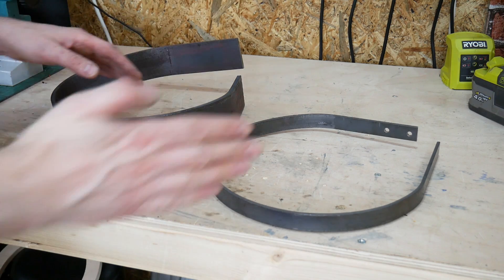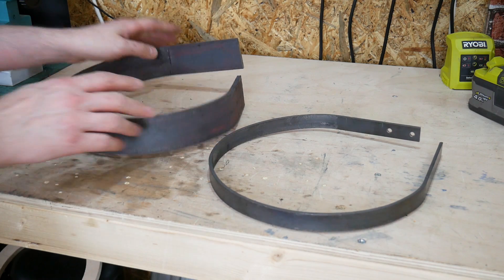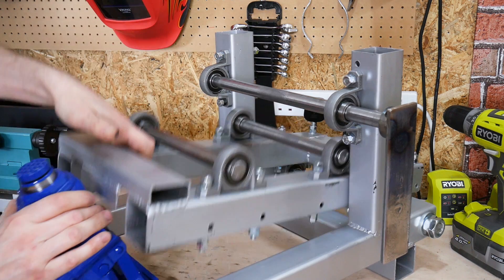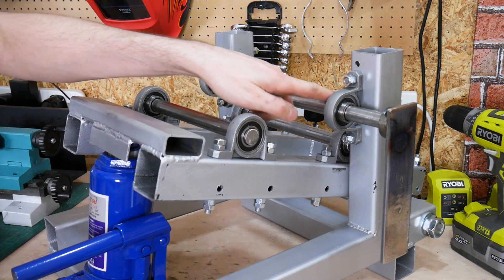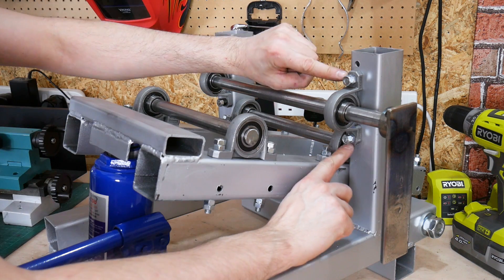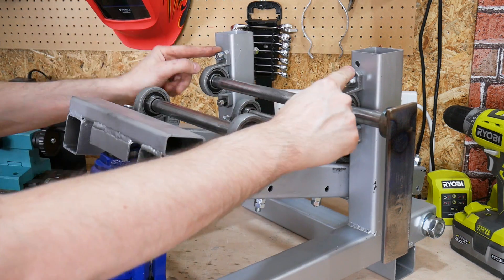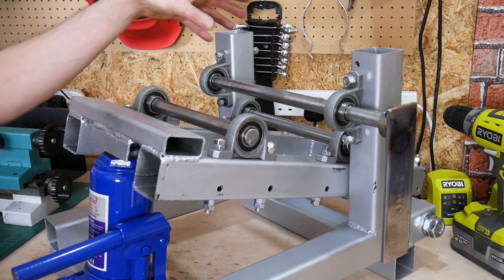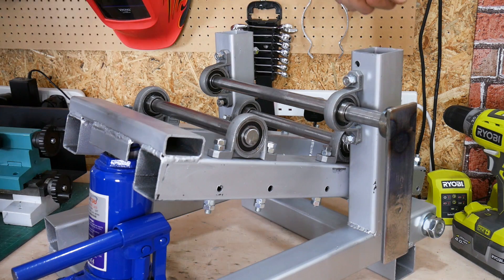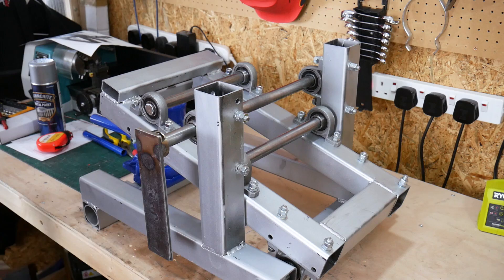You probably noticed as I was rolling that the material was going side to side in the rollers, and none of my pieces are perfectly flat — and why is that? Yes, my rollers are not parallel. These two are fine on this piece because it's basically one piece welded on steel, so I'm assuming they're fine, and therefore this one is the one that's running out. What I've done is drilled the holes out slightly bigger on this side, shifted it up, put a bit of steel in, and jacked it up to make sure it's the right height on both sides, then done the nuts up really tight. A future improvement would really be to make it adjustable, so you could roll a spiral if you wanted to — some commercial machines have an adjustable tower with a thing you can tighten up on each side. But that's the beauty of making your own tools — you can always cut it to pieces and change it.